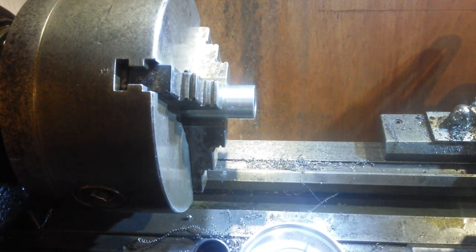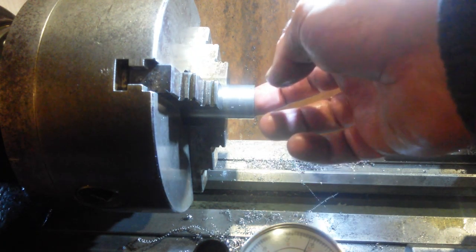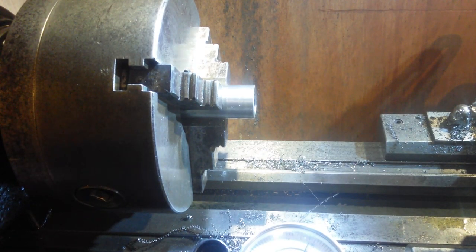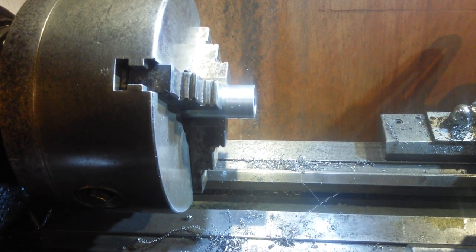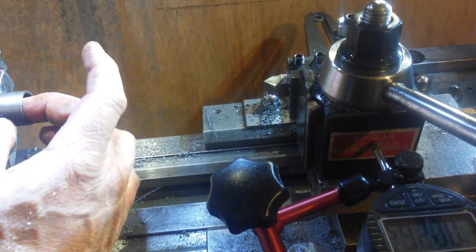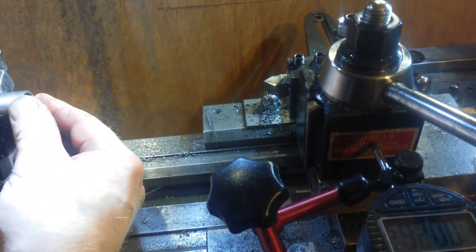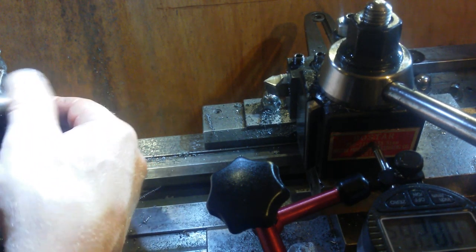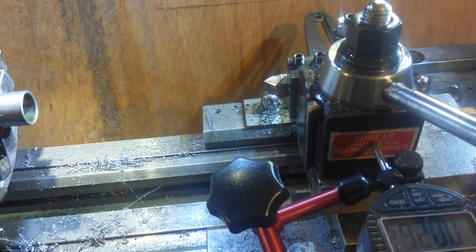Right, one thread in there and I'll just drop the collet. Oh dear. All the excitement of internal threading. Okay, so that part is finished. Is there a burr on it? Probably. So I might want to cut a bit more of a lead in now. Let's get rid of these DTI gauges. Just pause you for a second. Yeah, I was going to put the chamfer in, the 45 in there, but I'm thinking to myself, well, it's okay. I'm just going to give it some sanding to make it look a bit more pretty, and that will do.